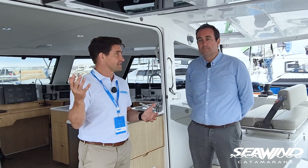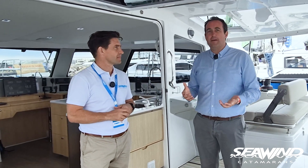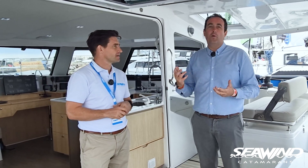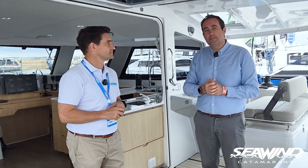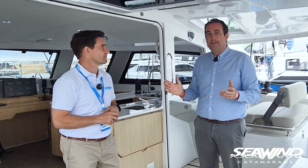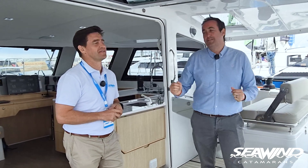Historically on recreational boats you're looking at theoretical numbers — it's not common to have this kind of data compared to racing. Our product goes to two areas: performance, where a boat wants more tension and more speed to get to the windward mark quicker, and safety in a catamaran environment — making sure you're not overloading the rig at night. It's like the tire pressure monitor in a car. With the BNG system you can see live loads and set your safe thresholds — dial up for a hard weekend, dial back for a comfortable family cruise.